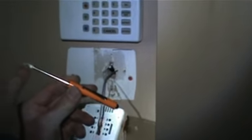Okay. Now, special screwdriver. You can see how small the blade is on this screwdriver. We need that. Okay? Now, we're going to be careful. I want to take a look before I start unscrewing things. I want to make sure, do you see this yellow wire? It does, in fact, go to Y. See the Y right there? So you always want to check that, okay? Now, I thought this thermostat would need a smaller screwdriver, but it really doesn't. But this one's good enough.